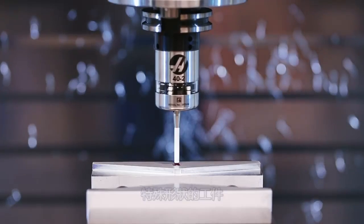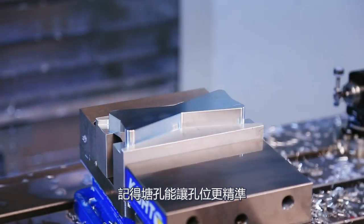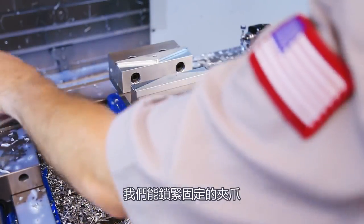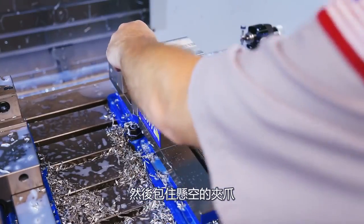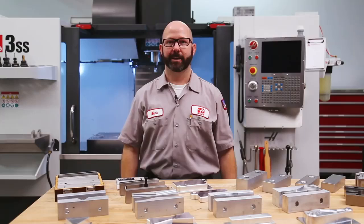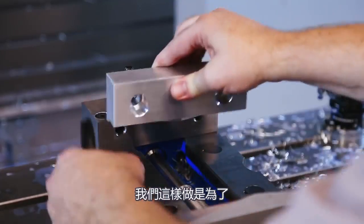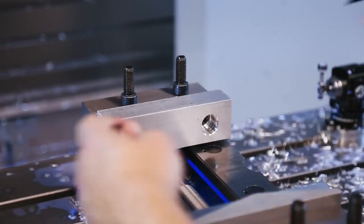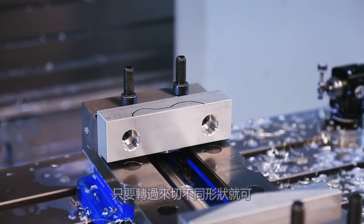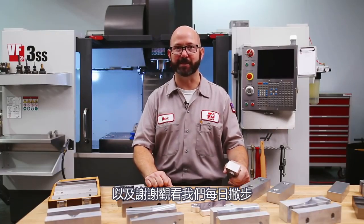With goofy shaped parts, we'll often drill and then bore a tooling hole, making it easy to pick up the work offset on these parts the next time they are running. Remember, boring always gives more accurate hole positions than drilling. If you are reusing soft jaws, we can tighten the fixed jaw and just snug the floating jaw, then clamp on a part for alignment, smack the jaws down with a dead blow, and then fully tighten. You might have noticed that the holes in our jaws are oblong — we've done this to make the jaws reversible. I can reuse these jaws just by flipping them over and cutting in a different shape. Thanks for letting us be a part of your success and for watching this Haas Tip of the Day.